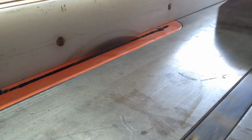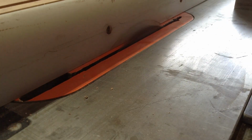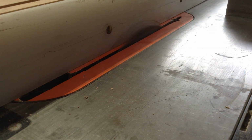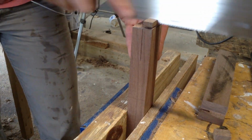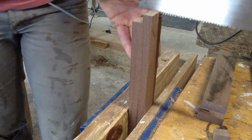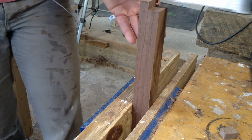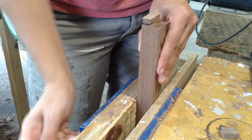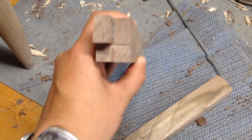So like I said, these I'm making in my shop, and the original ones just weren't tall enough for what I needed. I wanted a little bit more wood left over in the piece for the drawer slides, so I just thickened them up. But I could use the originals to mock these up, and then I could just hand cut that little piece off, and then that's the little nub that's going to be sunk into my mortises. So all I'll have to do now is go through and cut a large rabbet, and that is what the drawer will slide on.